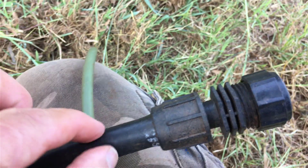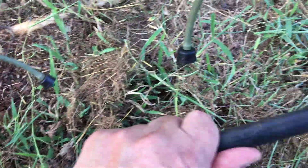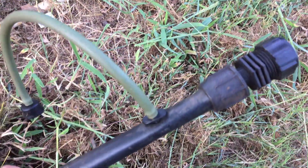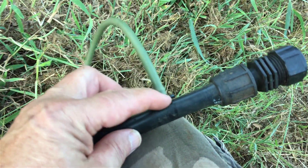I don't know how familiar y'all are with this stuff, but the pipe just pushes up on this fitting and then this screws on and tightens the pipe down — pretty watertight if you do it right. Then you poke a hole in it with their little tool and put a barb in there.